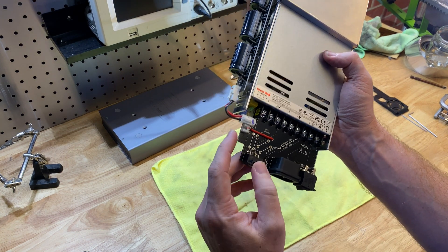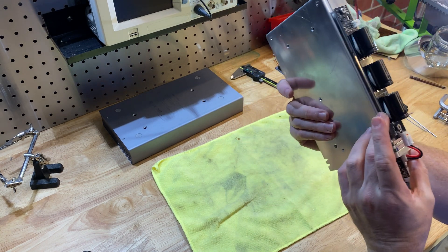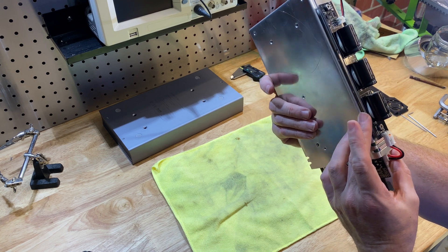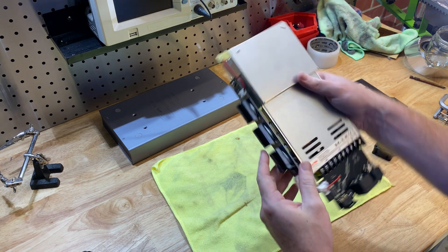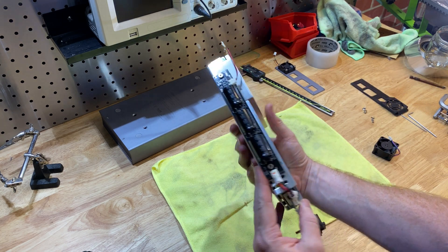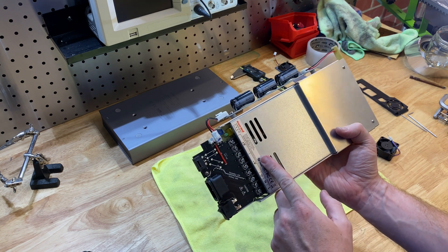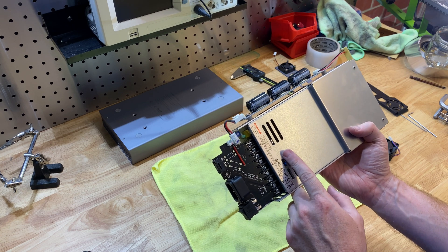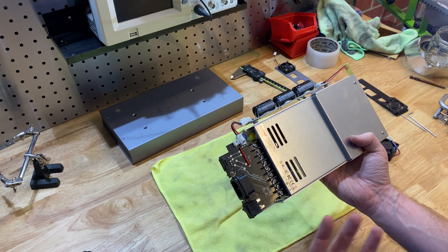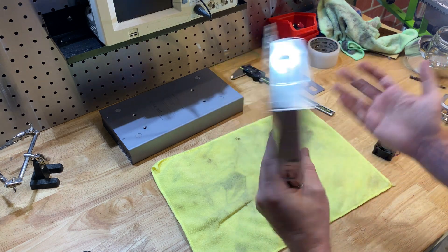Your fan header is there and there's this extra board coming off the side, which I believe is in parallel. Yes, it is — so they're all in parallel. There's 4,700 microfarad, 35 volt capacitors, three of them in parallel. I'm assuming that's to smooth the 24 volt output of this power supply. The only reason I can think of why they'd be doing that is when you're running the heated bed and the hot end together, when they switch on and off, it can cause quite a bit of voltage sag. So maybe these are just compensating for that a little bit. That's my guess anyway.